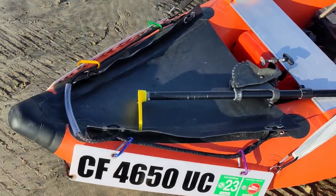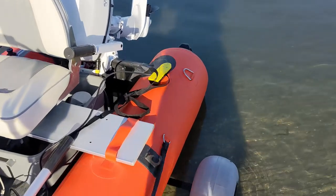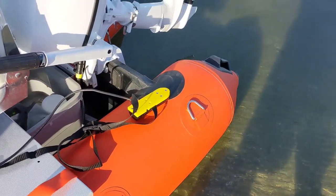I actually expect the submerged transom version to work at some depth, while I kind of don't expect the pontoon version to work. I think air gets trapped under the pontoon as you go forward and it's going to screw up the readings, but we'll see.